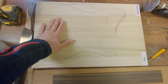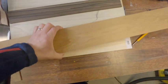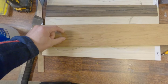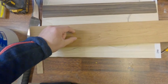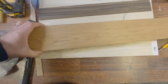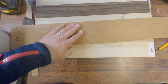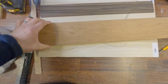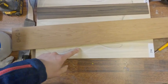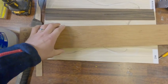And then we're going to inlay into this neck, of course, a truss rod and two carbon fiber support rods. So it's going to be real stable. Also, this torrified maple is supposed to be really stable to begin with. So I'm very excited to see how the neck's going to feel. So I'm just going to cut this out now, I think. And then we'll take it from there.